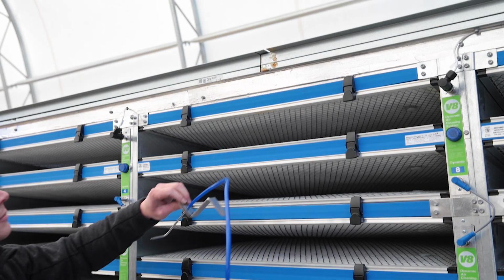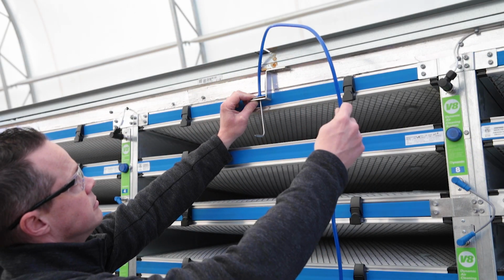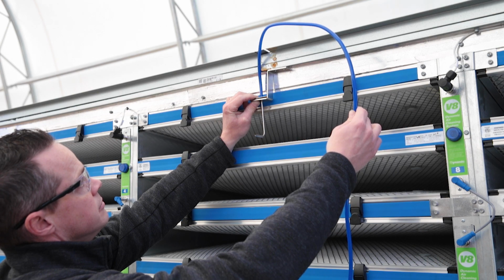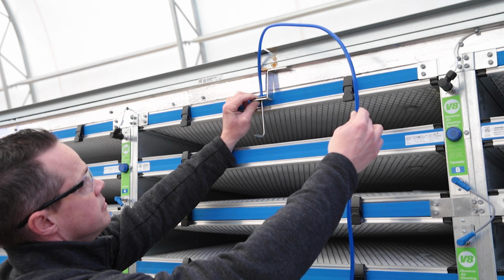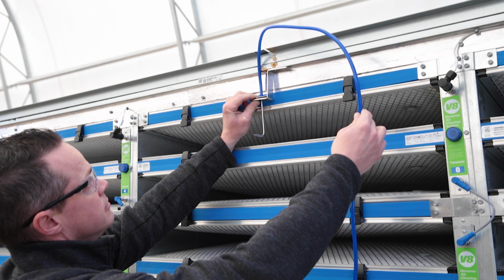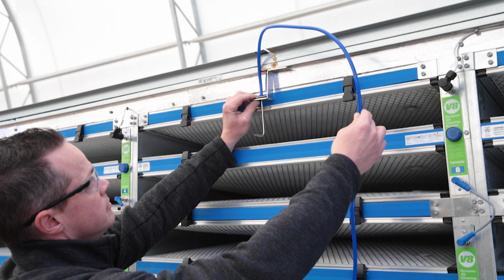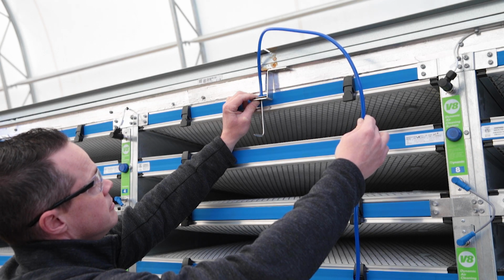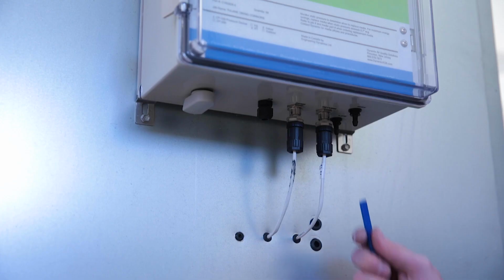Install static pressure tips in the air handling unit using the provided brackets and instructions provided. Static pressure tips should be located where the influence of air velocity is eliminated or is at an absolute minimum, usually on the ceiling or upper sidewall. One static pressure tip should be located upstream, 12 inches in front of the air cleaner, and one pressure tip downstream, 12 inches behind the air cleaner. Tips should point into the airstream.